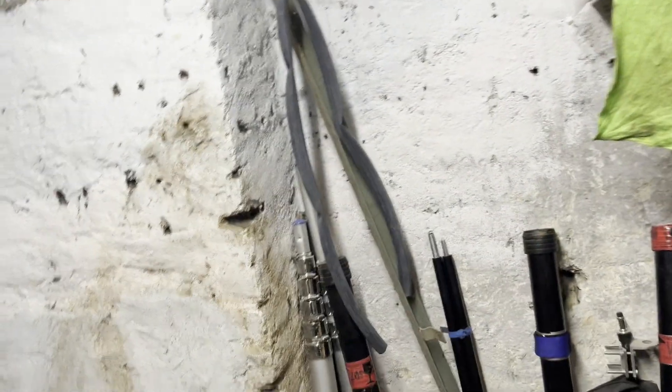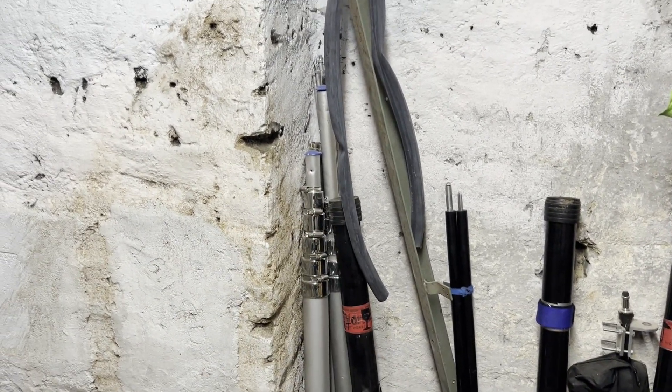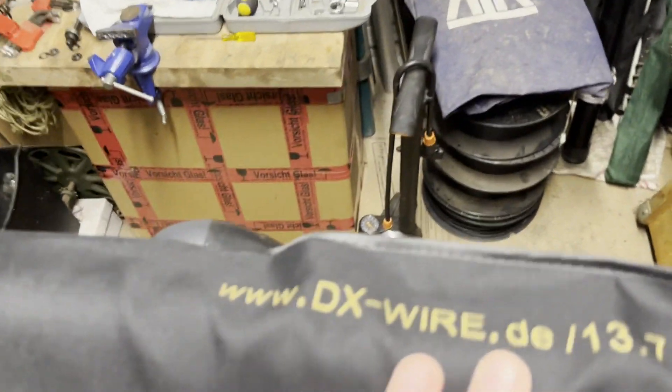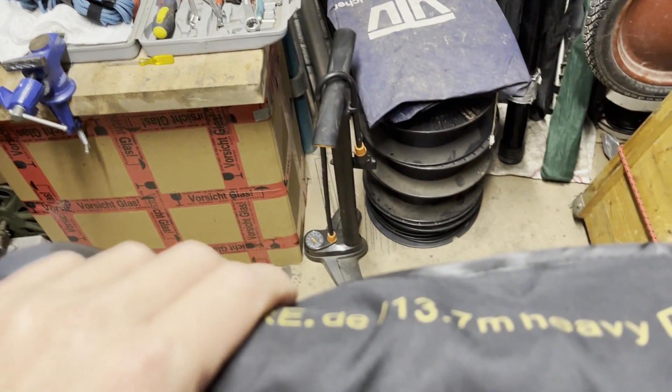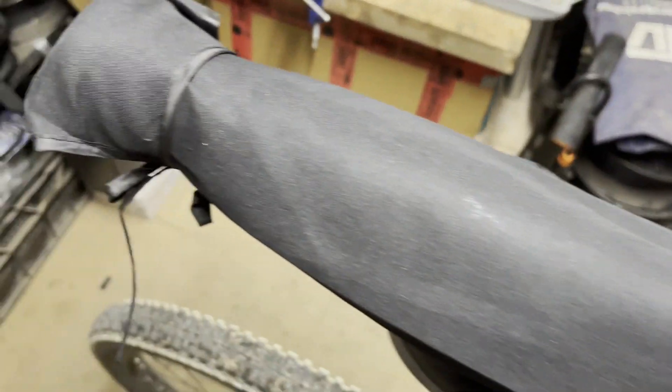People go like, 'Gunda, you got three 40-footer Spider Beam poles and two aluminum poles, 18-footer — what do you need that DX Wire mast for?' Well, that's very simple. I'm just going to use this one from DX Wire for my vertical, 45 foot and eight inches, a fat wire with a 9:1 on it, just for this heavy duty vertical. That's what I bought that for.